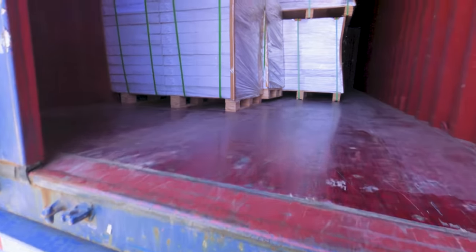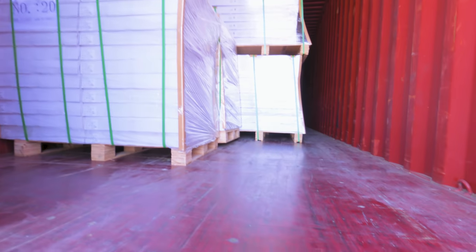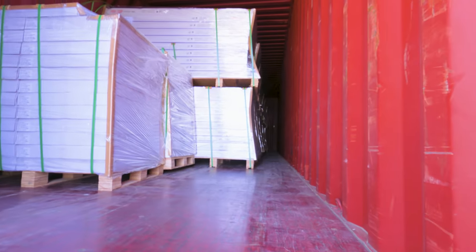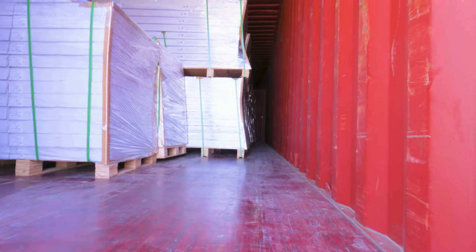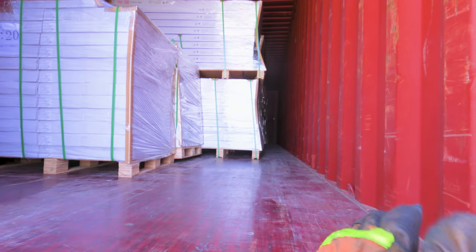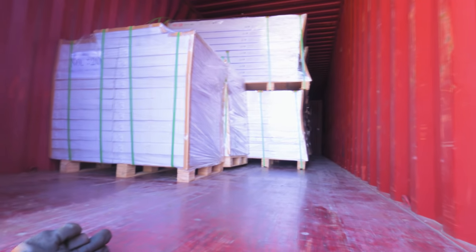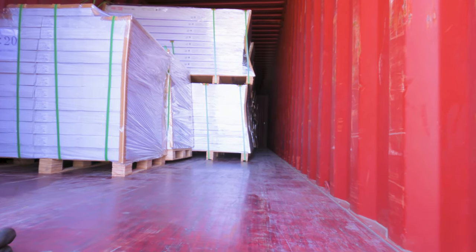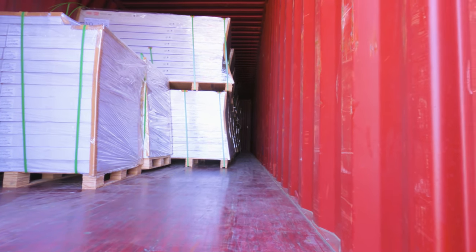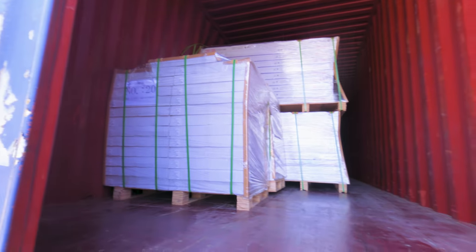Yeah. So just a recap of why this happened. This is a laminate shiny floor on wood. There's absolutely nothing stopping these pallets from sliding in here, which is why they flip on turns. It starts to shift a little bit and then it slides and the whole weight takes it over. So if I counterlean it, all that's going to do is we pick up on this end. It might not do anything, or it might just slide the load from here to here, and we're in the same boat. That's why we put these on Landolls. So we're going to set up for that right now.